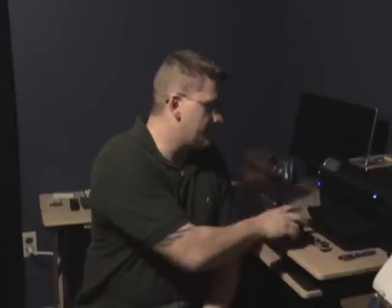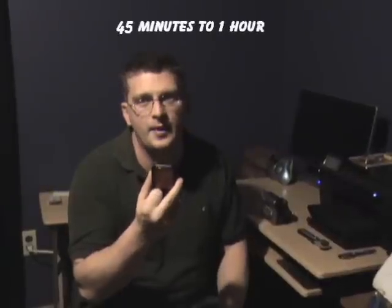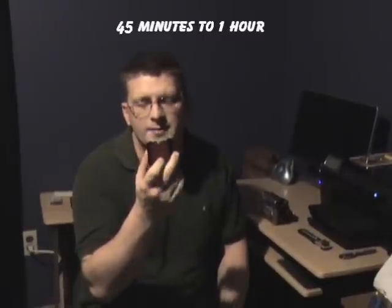The SL20 IR has a few drawbacks. One of the drawbacks is that when you plug your light in, it's going to take about three hours to charge it. After that long charge, you're only going to get about 45 minutes of use. Once that 45-minute mark hits, you're going to see your light flashing about 10 times and then it's going to cut off. This is a drawback if you want to set cameras up stationary, as you'll have to swap them more often than you would have to change mini DV tapes.